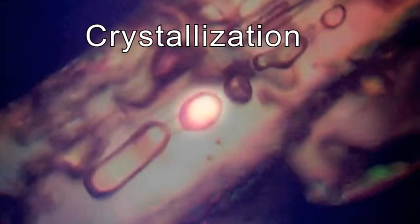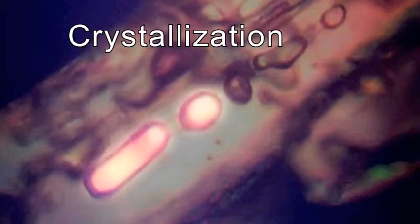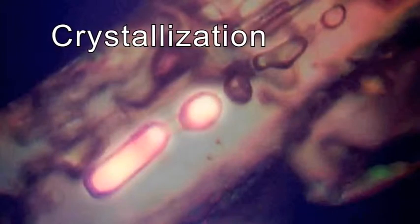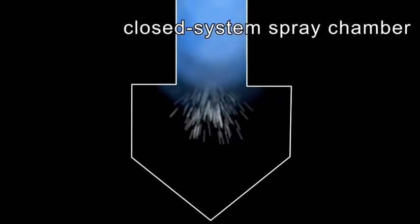This is significant because in the crystallization process, liquid bubbles or occlusions can form within the solid crystal, and impurities can be trapped within these occlusions. At Bergstrom, at the end of the distillation process, we have produced liquid MSM that has no impurities. The purified liquid MSM is stored in product tanks to be made into either flakes or powder form.